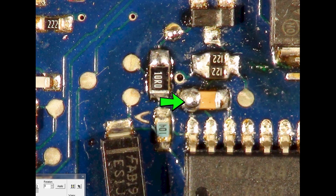I tried blowing one up to see what voltage it could take, because I couldn't find the spec. I took one out, put it on a high-voltage power supply, wound the voltage up, and it sparked over at about 80 volts - so I think it's a 50 volt part. So: 0.047 microfarad, 50 volt, X7R - those can be blown up.